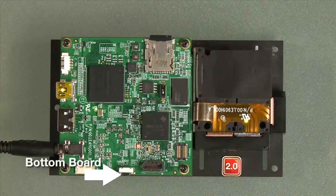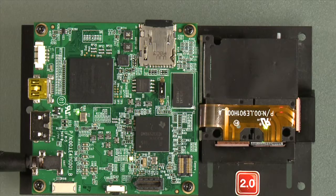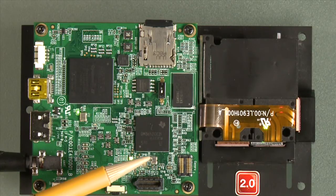This means it has copied the firmware over to the NAND flash part of the board. Now you can remove the SD card and it will boot up from NAND. Note that moving forward, the switch always needs to be in the position towards the DM365.